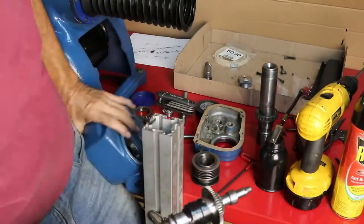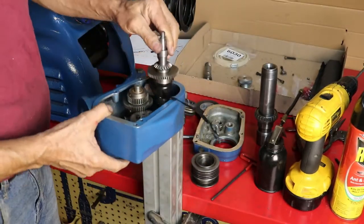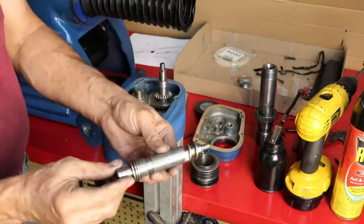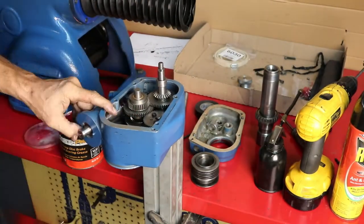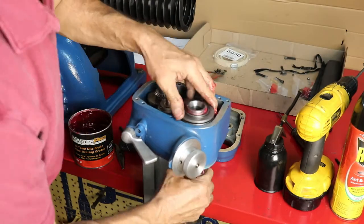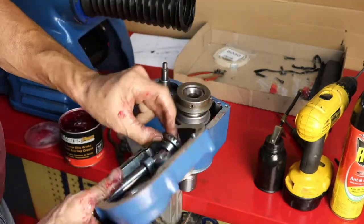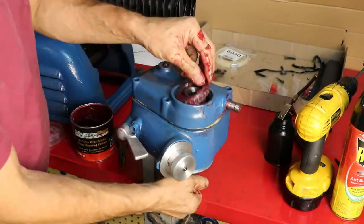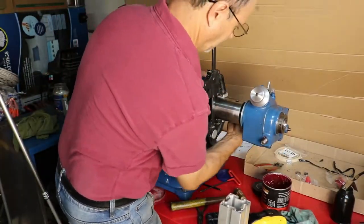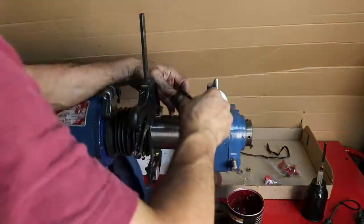This lead screw assembly — the only way I could put it together was by holding the pieces with vinyl tape or electrical tape, and removing the tape after it was assembled. There's a little spring and a couple of index clutches that need to be together to be installed, along with the rest of the gears and the clutch lever. The feed adjusting screw is ready to be installed along with the retainer and the dial. Now you can see how the mechanism works. Lubricating the bearings and spindle extension, threading with the Belleville spring and cap. The miter gear and shaft go on the cover — this gear is for the crank handle or manual feed. Finally, bolted together and ready to be mounted on the spindle.